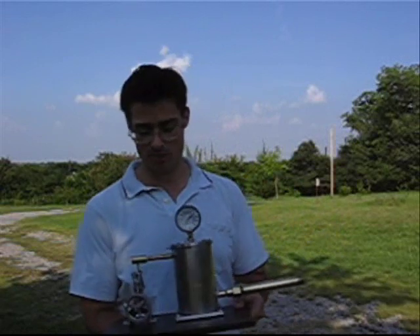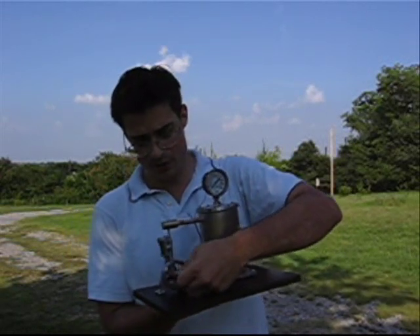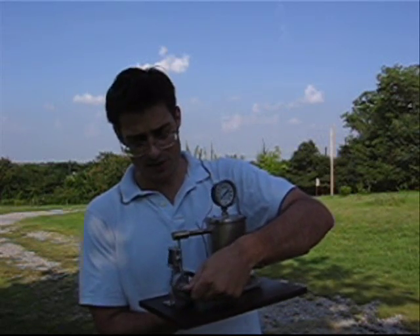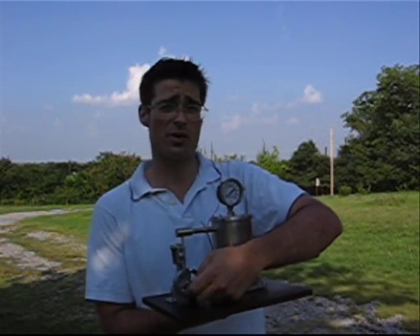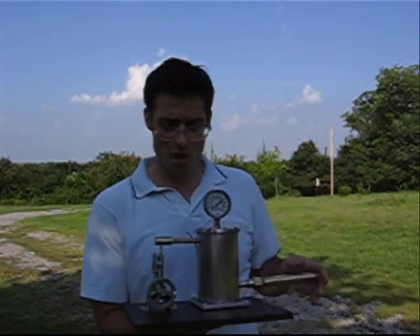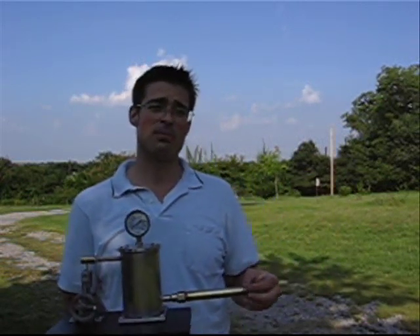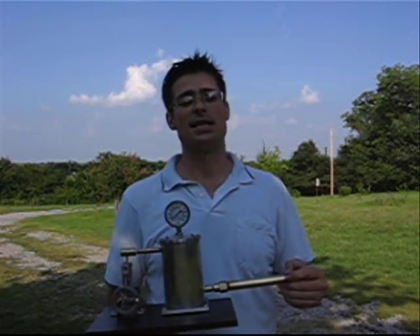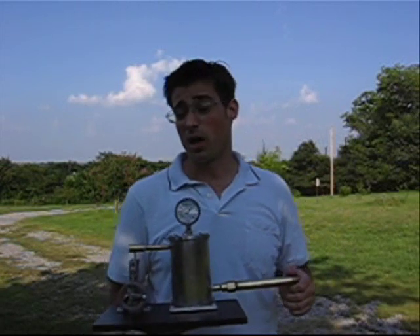Let me describe the engine a little bit. What you've got here is an old engine design — it's basically a two-way oscillating steam engine, but instead of running it on steam, we're going to run it on the combustion products of black powder. There's no air intake like a regular engine, which was one of the main mistakes with the show. Since black powder has its own oxygen source, it doesn't need the air intake, and so a steam engine works well for this.